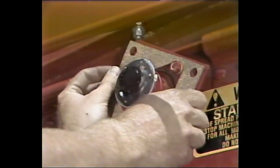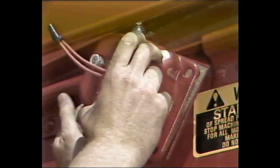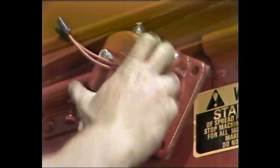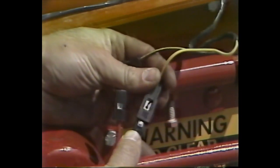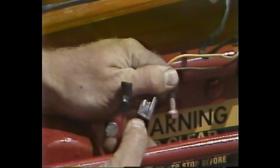Next, route the straw chopper rear belt in the pulleys provided and over the chopper drive pulley. Now, install the governor mechanism on the left end of the rotor shaft and install the warning mechanism as shown. Make sure the wires have sufficient length to allow the customer to slide the chopper backward in case he decides to bale the straw. You'll also find the installation of the straw spreader kit to be equally simple.